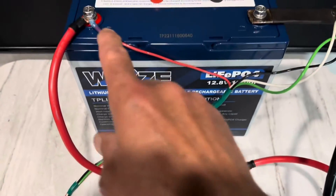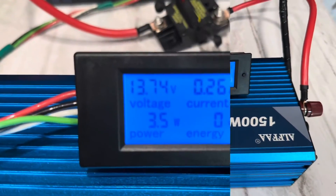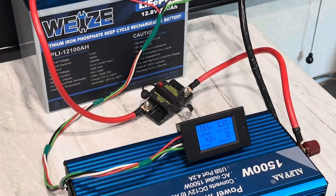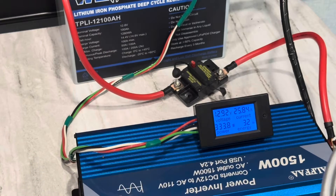I haven't even turned on the power to the inverter yet — just want to show you there's no hidden wires, nothing like that. This is a true real-life capacity test. I'll go ahead and flip the inverter on and get my load hooked up. This little alpha only pulls 3.5 watts idle — that's got to be the lowest idle draw of any inverter. For the load I'm using the Hamilton Beach Slow Cooker — a nice, stable, consistent resistive load, good for testing battery capacity. It's settled in at 333.8 watts. 32 watt-hours already out of the battery. I'll be back in about three hours to check on it.